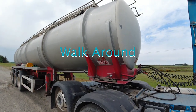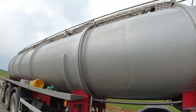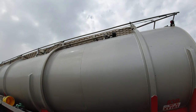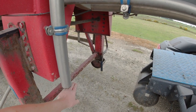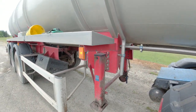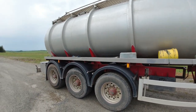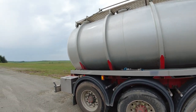Here's the tanker — my tanker number 83. It's a single pot tanker. Up there you've got a valve — it's a breather valve which you can open from the control panel. When opened, you can put your hand underneath it and feel if it's sucking air in when offloading, or blowing when loading. If product starts coming out of there, something's wrong and you need to stop your operation. Apologies — she is a bit mucky, I just haven't had time to wash her this week.